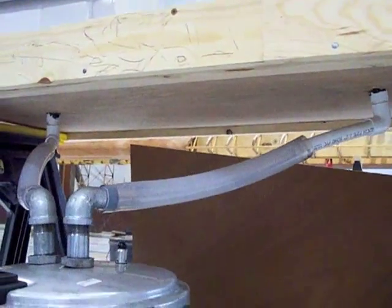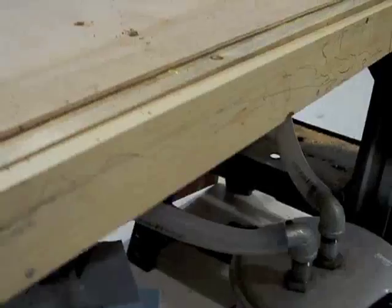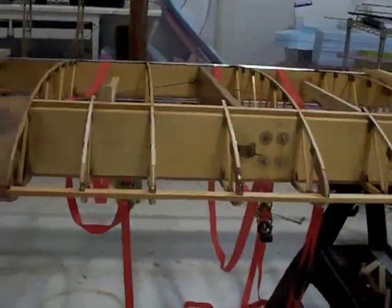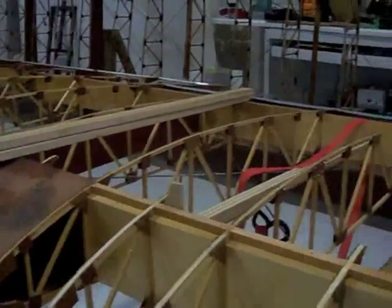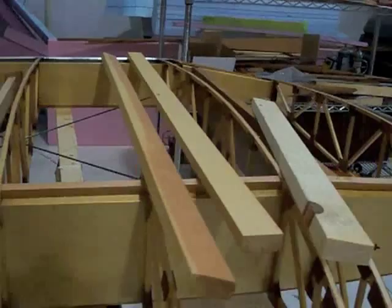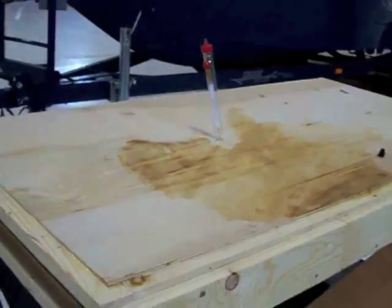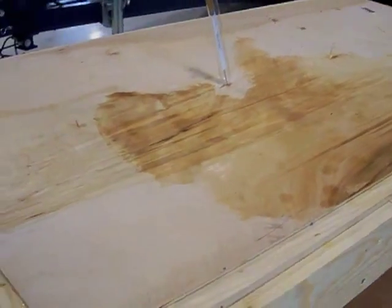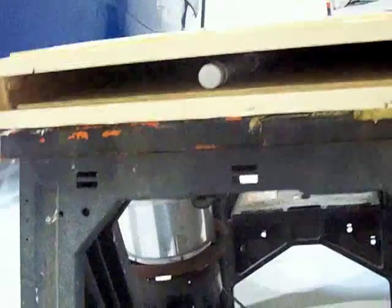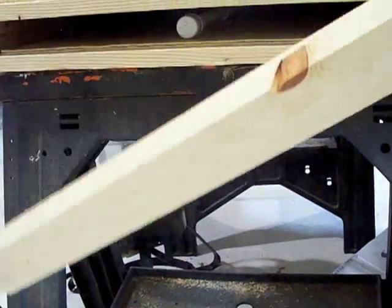The steam goes through the bottom. I'll be looking for a temperature of about 200 degrees. I've got a nice big burner, there's my pressure cooker, and here's the leading edge of my wing — I've done one already, bent that around. I've got some straps and some little pieces of wood that'll lay across the top. I've put screws in here that allow me to take the lid off the box and place the plywood in. There's a hole in the back with a plug piece of wood that sticks in and plugs up the back.